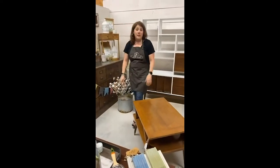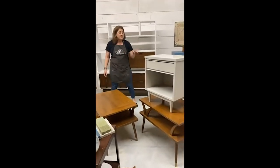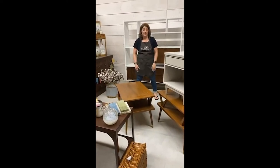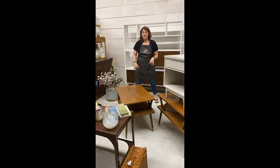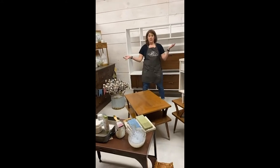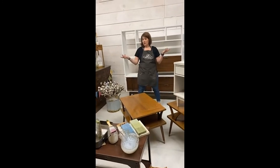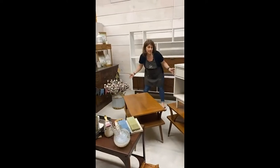Miss Lori actually painted our floor. We only got one coat on it. It's grain sack, but we're going to paint the whole entire floor in grain sack, and I think we're going to do a fun stencil, so maybe when you join us next month, that'll already be done. Our floor is concrete, and Lori, did it stick? Yeah, it's stuck just fine. I did use bonding agent in the first coat. I don't know if I will again. And then we might put some polyurethane over the top after the stencil. Maybe, but it's stuck really well.